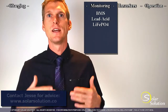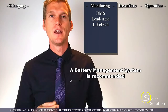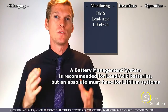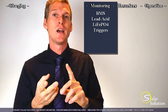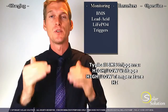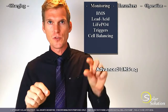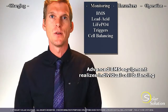The reason for this is that if you would operate your lithium battery outside of the recommended specifications, you would either create a dangerous situation or permanently damage your battery. What the BMS will do is disrupt operation if you operate the battery at very high or low voltages, at very high or low temperatures, or if you exceed the preset amperage rating. An extra benefit of advanced BMS systems is that they'll often balance the individual cells, making sure that each and every component works just as hard as the other one.